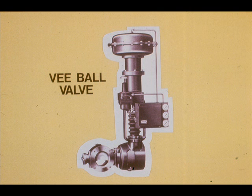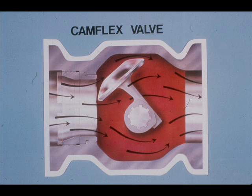Butterfly valves require considerable actuator force to operate them at high-pressure differentials. However, they are low in cost and will permit about twice the flow rate that a double-seated valve of the same size will permit. Variations of ball-type valves include the V-ball and the Camflex. The Camflex uses an eccentrically rotating spherical plug. When the plug seats itself, the plug arms flex and a tight shut-off is obtained.